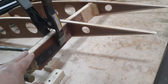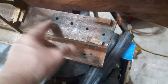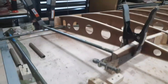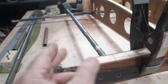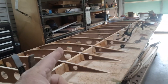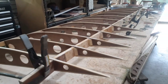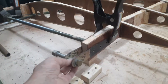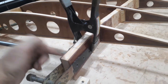I'm not going to drill up for the upper wing yet. I just took this old spar off the lower right-hand wing and match drilled the mounting holes to the new spars. I'm not going to do that yet because the left-hand lower wing had a gap between the root rib and the fuselage that kind of tapered funny. So what I'm going to do is put the fuselage up on the table, mount this wing to the side of the fuselage where it goes, get the nine-degree sweep angle proper, pin it into fuselage stations three and five, and then mark where these go to keep the proper gap between the fuselage and the root rib. Then I'll drill these up.